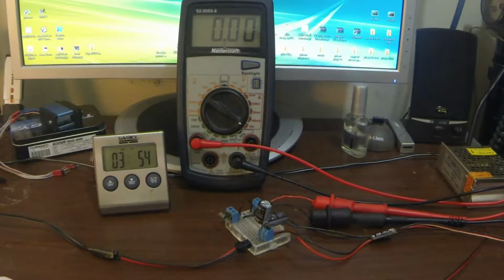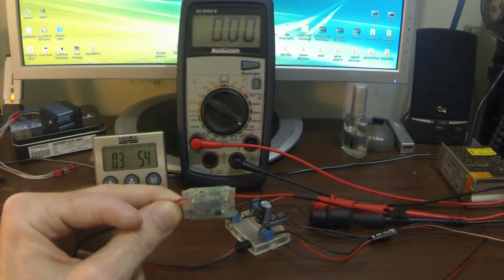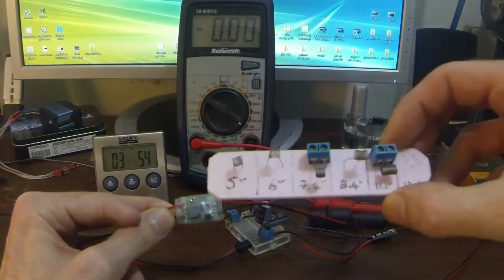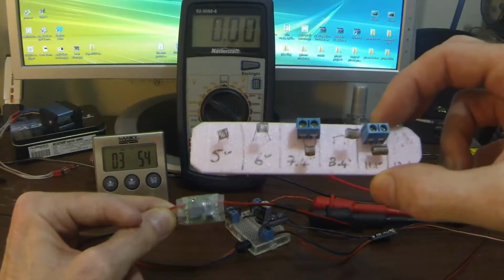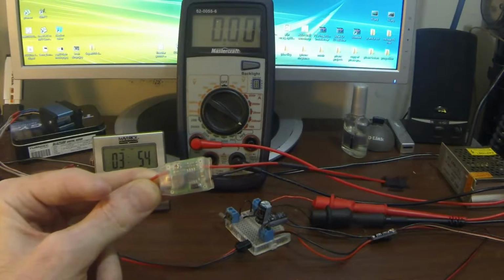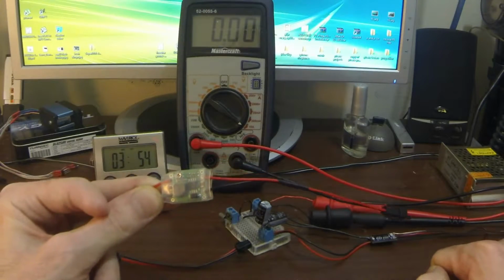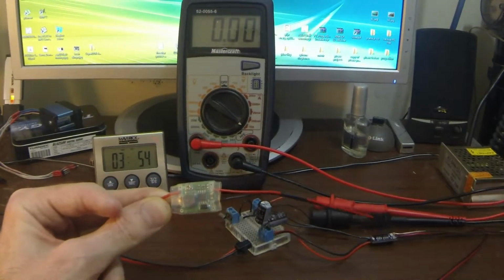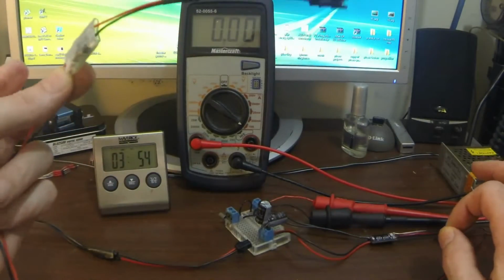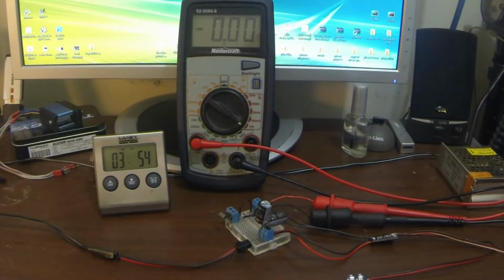Originally I was using a switching DC to DC step down regulator for testing at lower voltages, pulling 2 amps with various different coils set to get that current at the voltages. And this would get hotter than the controller itself trying to supply that 2 amps, even though this is supposedly a 3 amp peak current. Obviously peak current means for a brief period, but even at 2 amps or less, this would get hot and it would struggle to keep this fed for the duration of a test even this long.